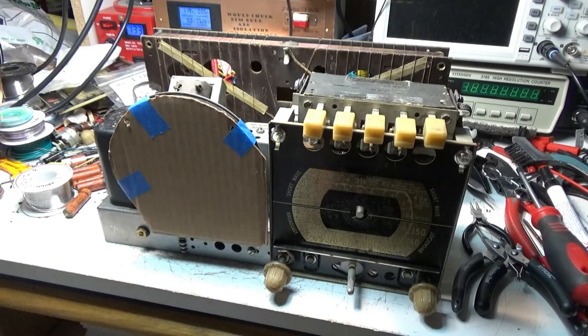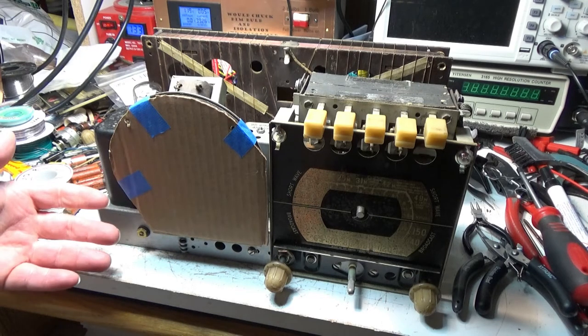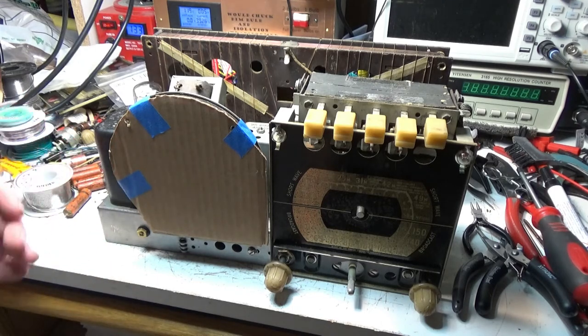So I thought it was wired correctly when I got the radio. When I turned it on the first time, it hummed. I just assumed the electrolytics were bad, so I went ahead and changed it. Turned it back on after I got all the rubber wire changed and everything. You've seen that. It was humming. So, let's look at the schematic.